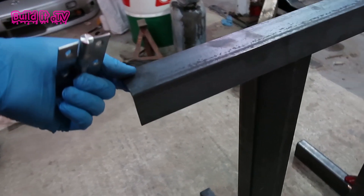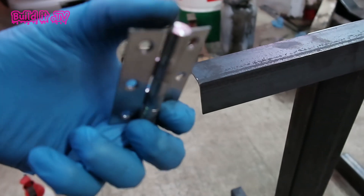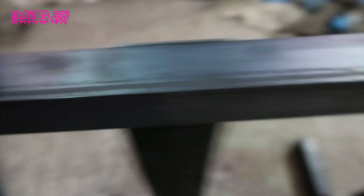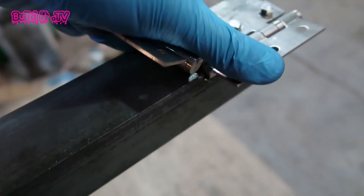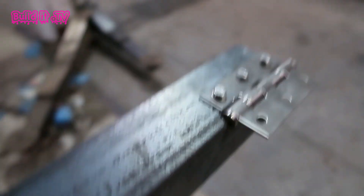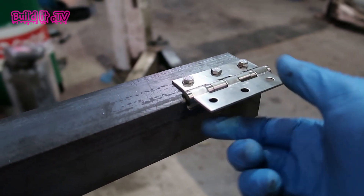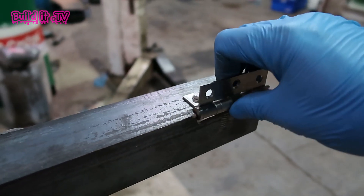We need to make sure the hinge is going to work properly, so we actually need the center part of the hinge to be right where the sharp line is, because that's where our cut is going to be. If we just put it here we're going to have a massive great gap on the bend. So what I've done on this side is cut out a notch in the metalwork, and that has our hinge sat on it, allowing it to bend all the way from where it sits naturally up to well past 90 degrees so we can get a sharper bend if we need to.